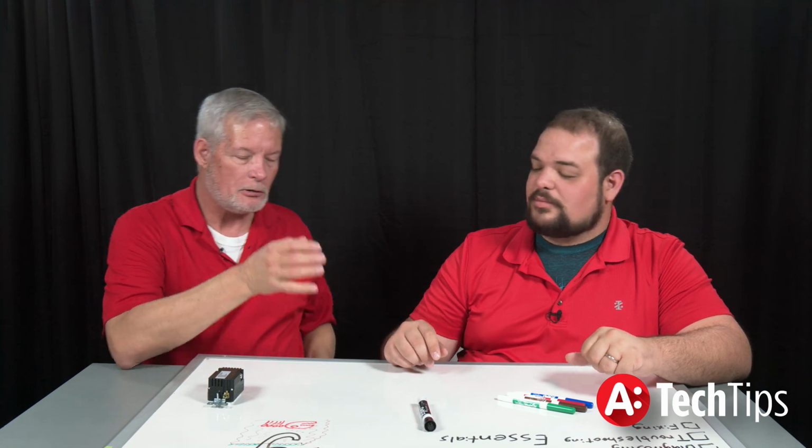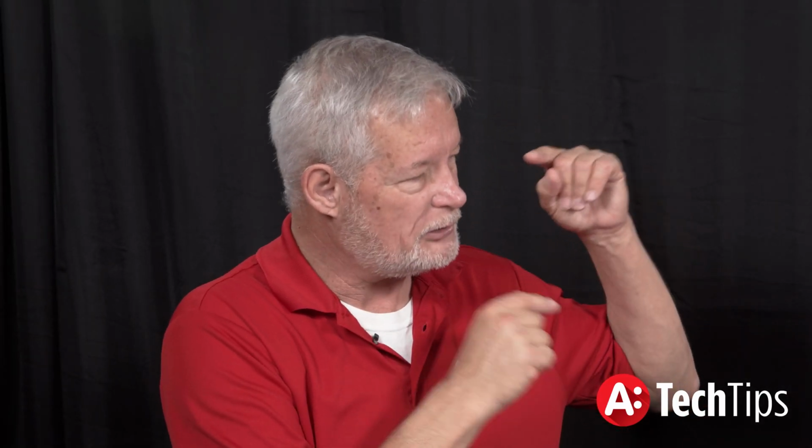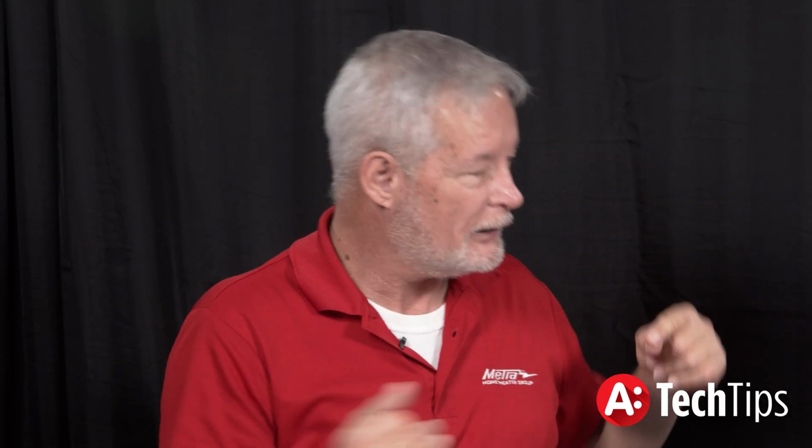Well, we're back to the extension cord. Exactly. With the extension cord, grounding is generally done at the receive side, more important than the send side. It's just like for car audio guys, you always have the really big ground at the amplifier, and you take everything to it. Right. Because it is the largest current draw. So you want that to be the shortest length of wire, and you want all the lesser current draws to go to that.